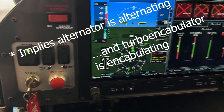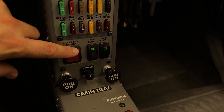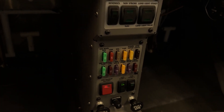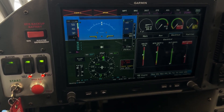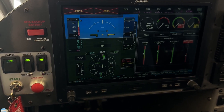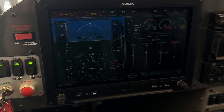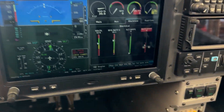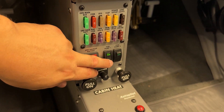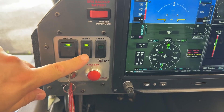And there you just saw that the Lane A and B lights went out and the fuel pump died, although the lights are still on. Two ways around this: you can either flip the EMS battery backup and restore power temporarily so you can start the engine — just make sure you turn that switch off when running — or you can simply cycle the master switch. That's why this is a service letter; you guys don't have to do this, it's just a small annoyance.